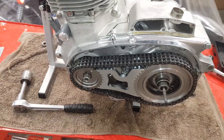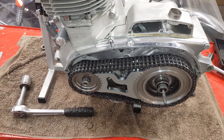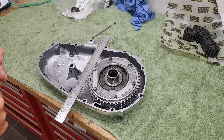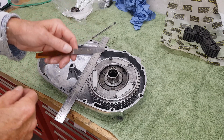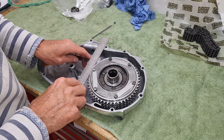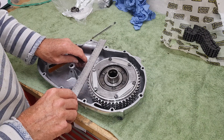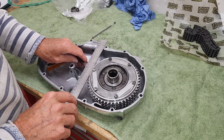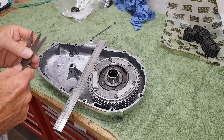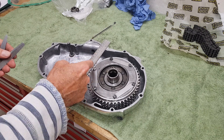Hopefully that makes a bit of sense. When I did it for real I don't think I explained it very well — it was all a bit of a rush — so I'm just trying to explain the logic so that when you see all the measurements it makes sense. So I'm going to get my feeler gauges. I've already measured the gap and I'm going to measure that gap between the chain wheel and my flat edge — in this case a ruler — and that is pretty spot on at 55 thou. So that's my first measurement: from the edge of the chain wheel to the outer edge using a flat edge is 55 thou.